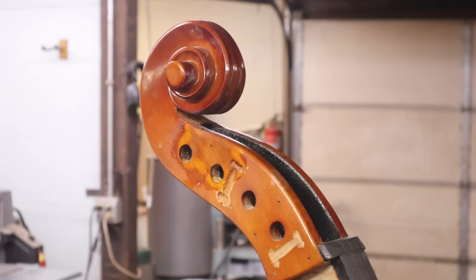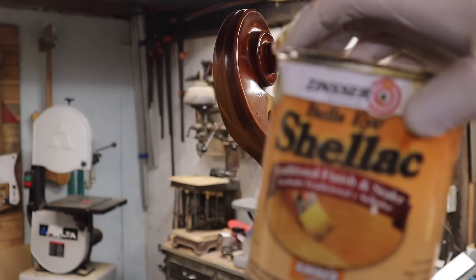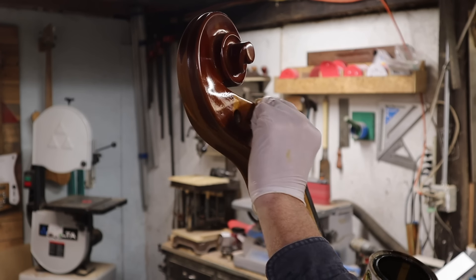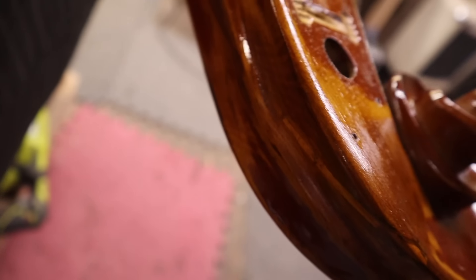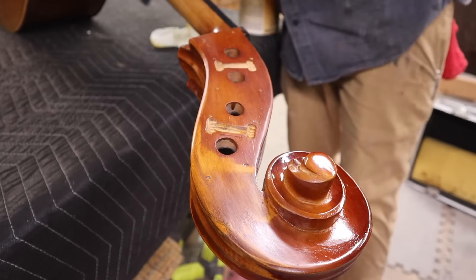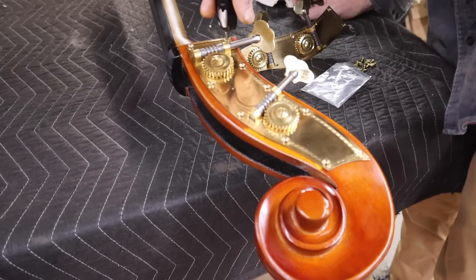It's not quite the same shade, and this is where the big difference between having me do this versus a professional really shows — a professional would have the right materials and experience. Since my Kintsugi didn't really work, this color change almost acts like it: all my silver epoxy just blended right in under the tint. I applied the tint and shellac over the worked area to blend it into the existing finish using pillow pads, then finished up with some homemade polish and put it all back together.